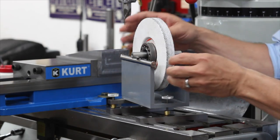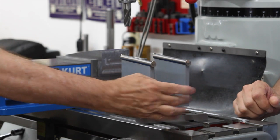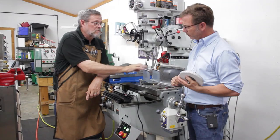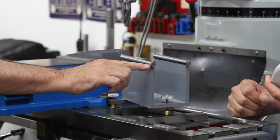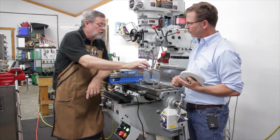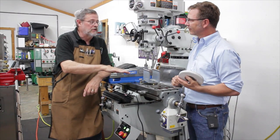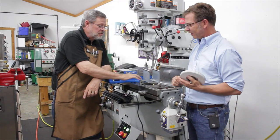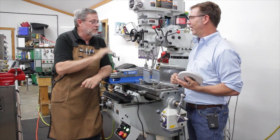When I went to make the balancer, it's easy to make a plate, bolt two verticals to it. I wanted to use ground drill rod here so I didn't have to worry about a good surface finish. So I took a ball end mill and milled them end to end with a semi-circular pocket, put a bead of JB Weld down, and turned it upside down on the surface plate so I would know that these two rails were parallel. So when I set it up and leveled it, I knew the wheel would be perfectly true.